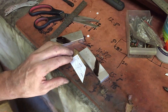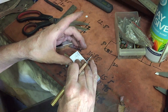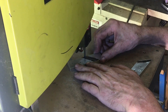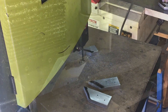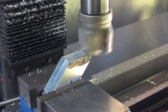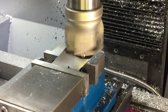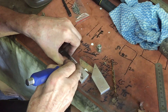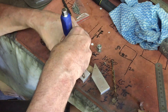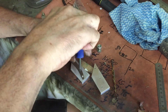The inserts need a bit of relief angle cut in them for clearance for the jaws as they move inwards and outwards. I'm screwing one of the handle sides in place on these blanks and I'll just use that as the guide to cut out the shape for the blank.